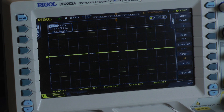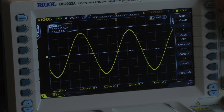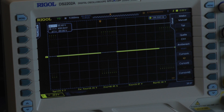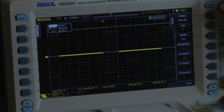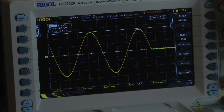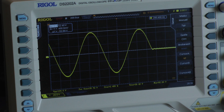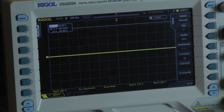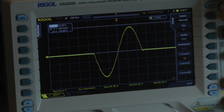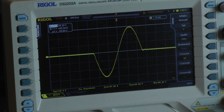Now I am testing with 8 milliseconds. First cycle: 52.8 volts. Last cycle: 52.4 volts. With 8 milliseconds, the amplifier delivers 176 to 178.7 watts into a 2-ohm load per channel, both channels driven. Now I am checking the absolute peak power — peak RMS with 1 kHz and 1 cycle. I got a peak voltage of 59.2 volts.